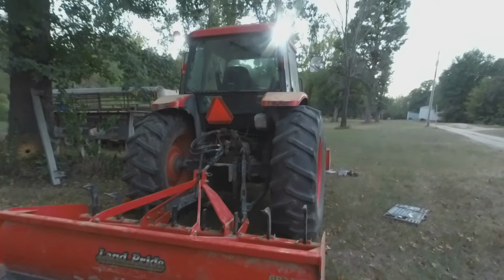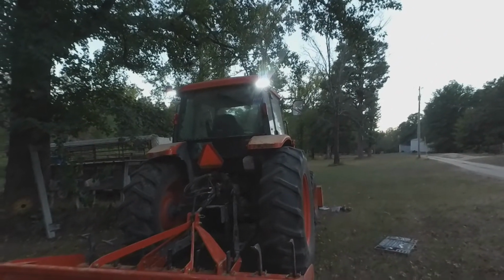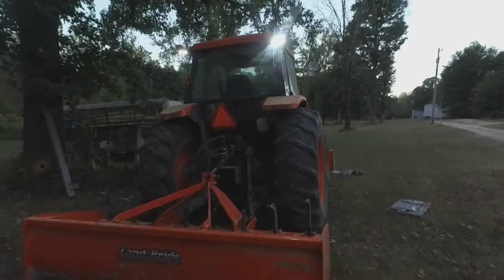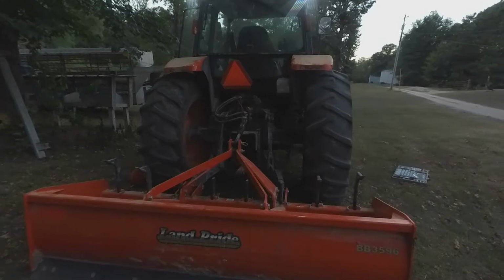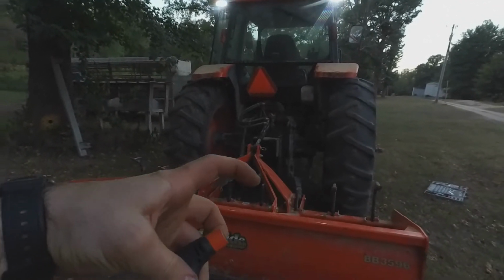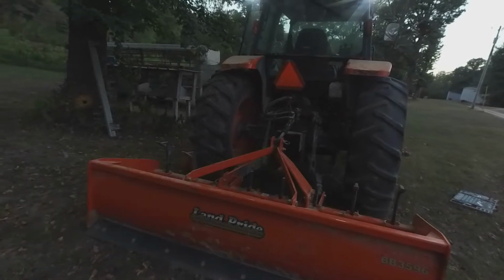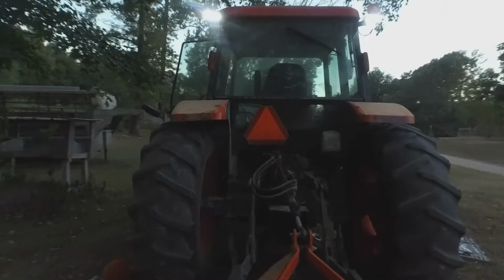One thing about a flame like that is it tends to burn the insulation a little bit if you're not careful. Just need to move it around a lot, keep it moving, and don't hold it in one spot too long. And also watch where your fingers are, because that flame is shooting out 2-3 inches, so it'll burn your fingers pretty quick.